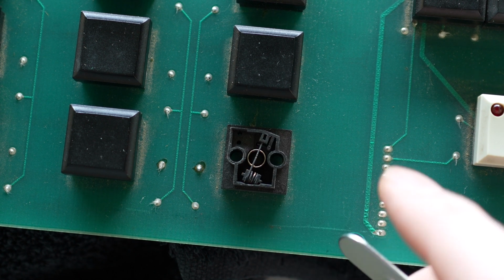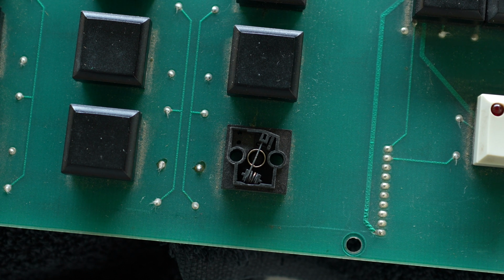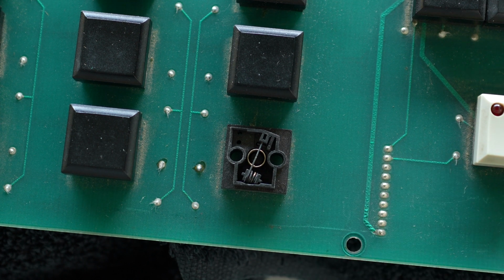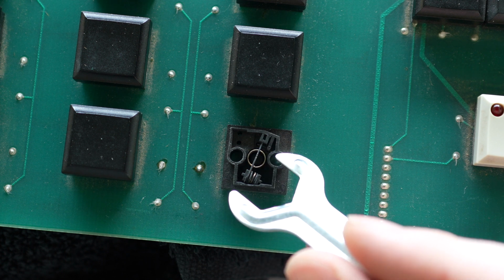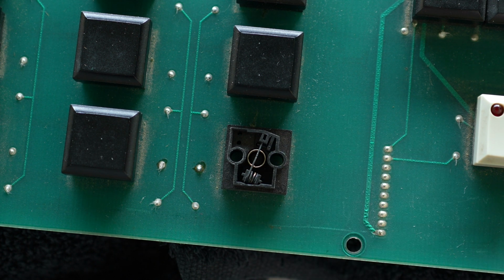That is just a little bit too hard to see, but it's underneath this area. And when this angled wire makes contact with this one underneath here, that's when it triggers the sound. It completes that circuit. So what you want to clean is the bottom side of that wire and the top side of the other wire so that connection can be made.